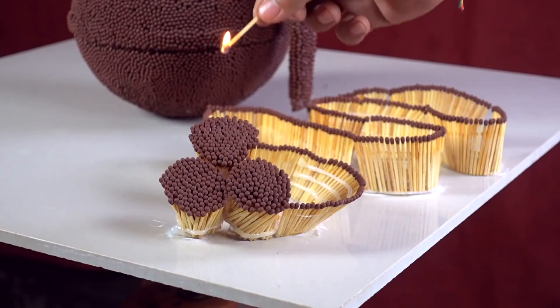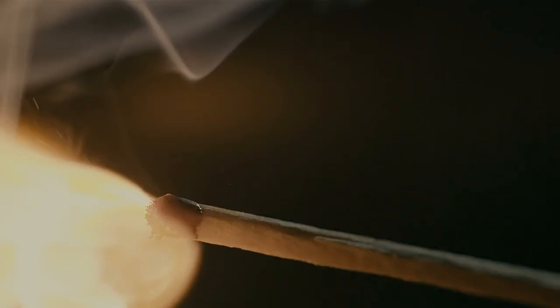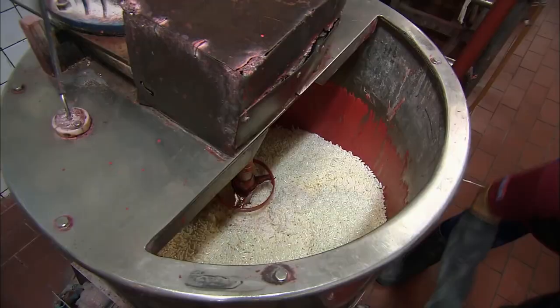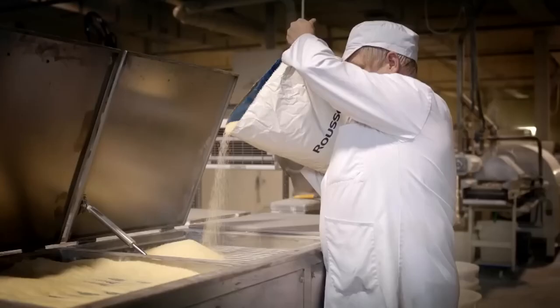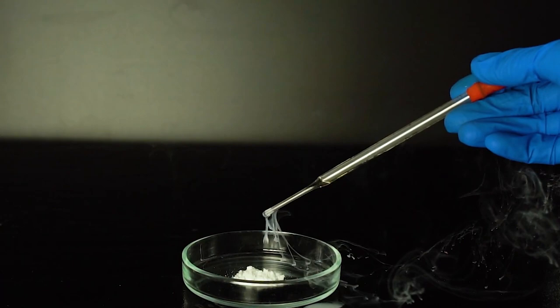The chemical mixture at the end of the matchstick is by far the most important component, which is especially impressive considering it is made up of only a few simple components. It all happens in a large industrial mixer where a worker manually adds gelatin capsules over some potassium chlorate. Gelatin is an organic substance used to give flexibility while also dissolving other components. Here it plays the same role, giving the chemicals something to bind to while also helping them stick to the splint. Potassium chlorate is the chemical that combusts upon friction.